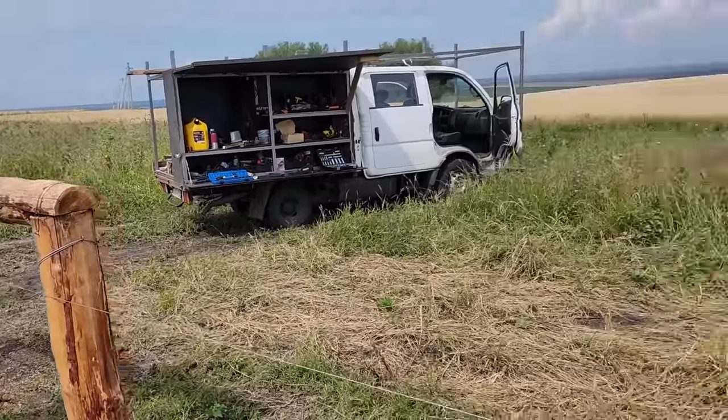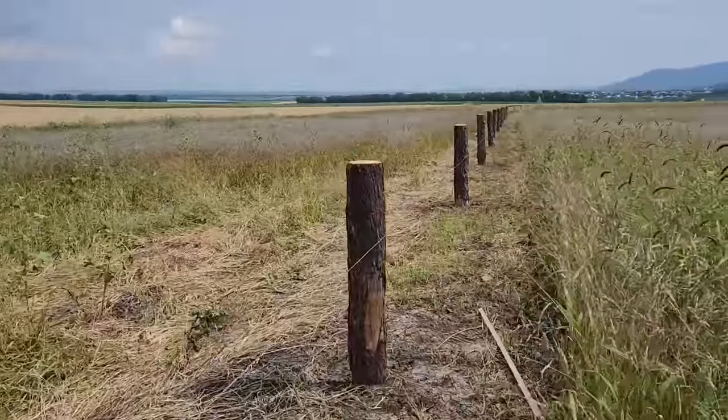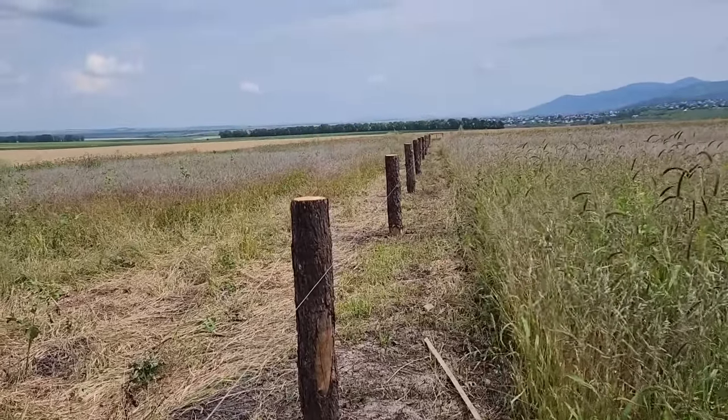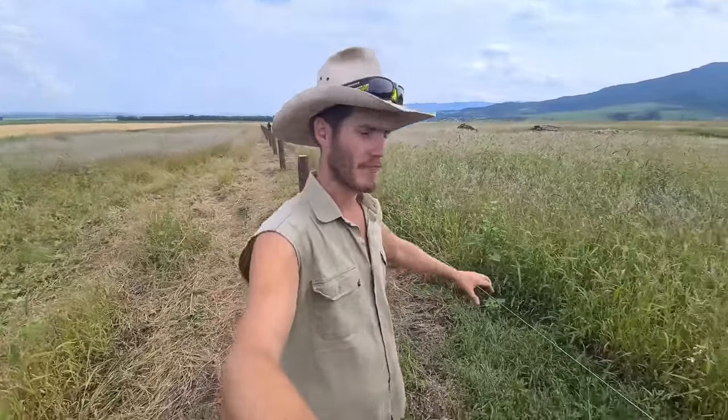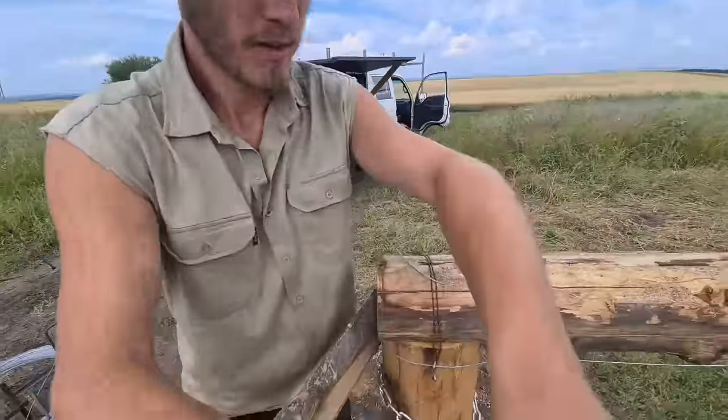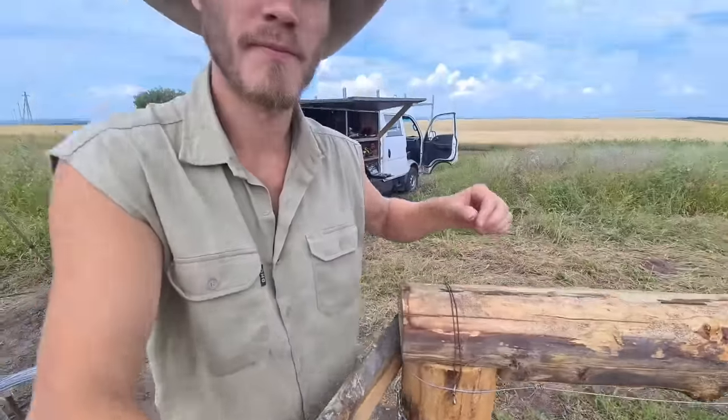All right, so Joash is pulling the tension tight, and if we look down here, I don't know if you can see, but the wire's slowly coming up, and the loop's coming out as the wire gets tighter and tighter, or the sag's coming out. Okay, we've got our first wire strained. This is a test wire just to make sure that the wire actually does what we want, and thankfully it does. It's got a good strain on it. It's not stretching too much, because if the wire is too soft, it'll just keep stretching and it won't get tight. And sometimes you can't tie it and do knots like these ones here, it'll just snap. But it can do all that, so we know that it will do the job we need.